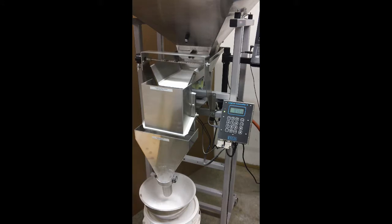There we were a little bit light before the end of the dribble cycle. Basically, the load cell was filtering out some of the chatter it was receiving, and then it understood it wasn't at weight, so it corrected itself.